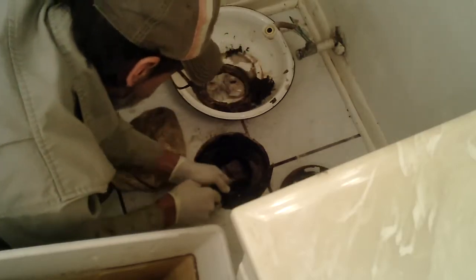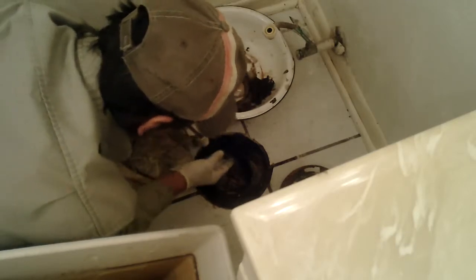I know that my flange needs to seat at least an inch and a quarter into the pipe. And I've got a ridge built up around here, just keeping it from driving into the cast iron pipe. Now, apparently these bolts have been replaced several times because I found a set of bolts down in the bottom here. It's a very poor plumbing finishing job here. You've got to deal with what you got.